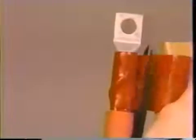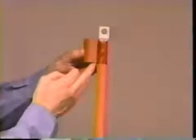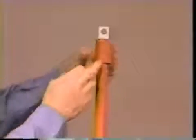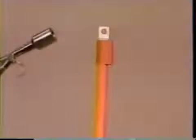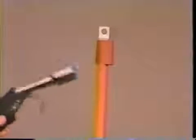Now, using light tension, wrap two layers of red sealant around the lug barrel. Place the shim tube over the red sealant, butt it against the end of the insulation. Set your torch pressure according to the manufacturer's instructions. Light the torch, making sure you have a 12 inch bushy flame. Shrink the shim into place.